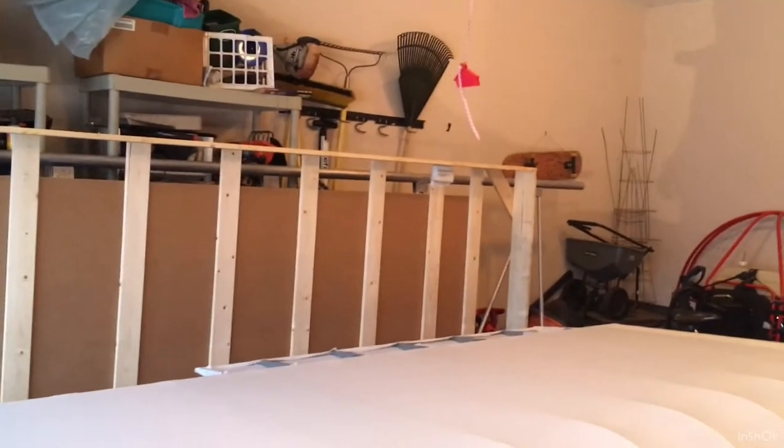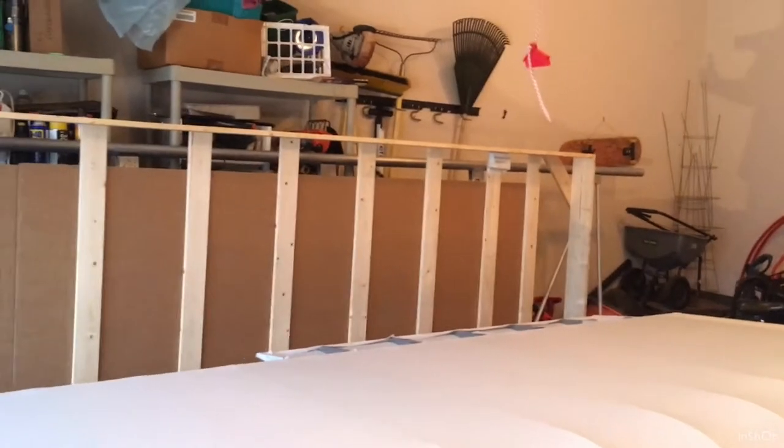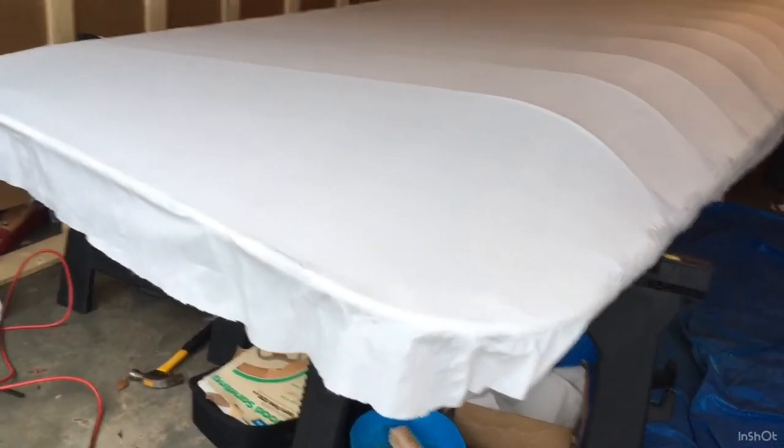Just covered it. Now I have to kind of cut it and tuck it up underneath and glue it underneath the bottom — just really nice. Six inch seam tape is going to be in the leading edge and the trailing edge. The trailing edge flaps will get 2 inch seam tape at the back, just like the ailerons, with 3 inch seam tape in the front. And I think it's 3 inch around this tube, just like the elevators for the wing tips.